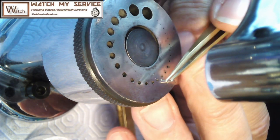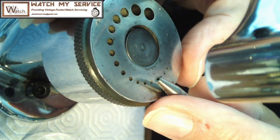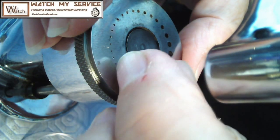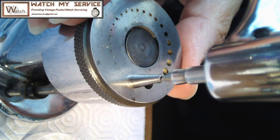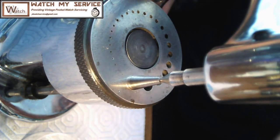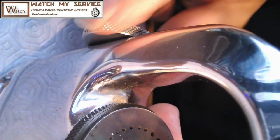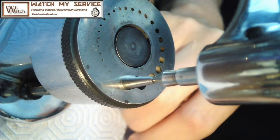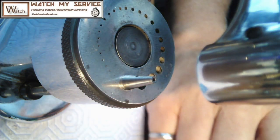I'm having a gander at it and figuring out what to do next. I've got a reversing staking set so I'm able to use a stake as a stump - the old stake and stump. I'm centering the stake in the staking set here. I've got the centering stake in there and I'm tightening the back just to make sure that's completely lined up. There's a mechanism on the inside that's cammed and the cam turns and tightens the table on top so it doesn't move and is absolutely centered.